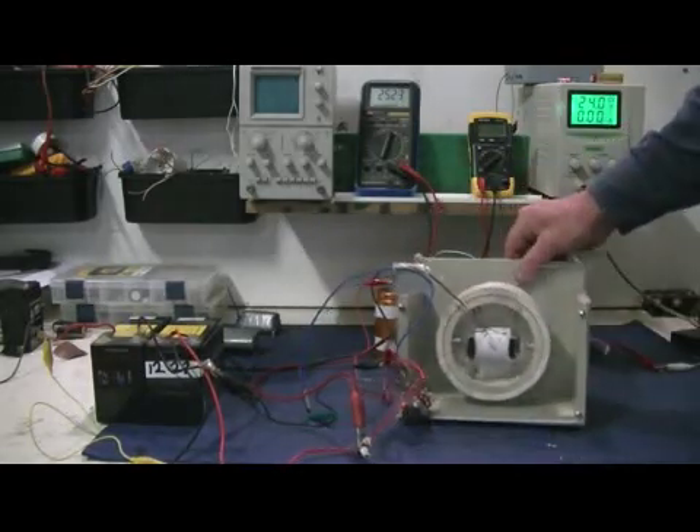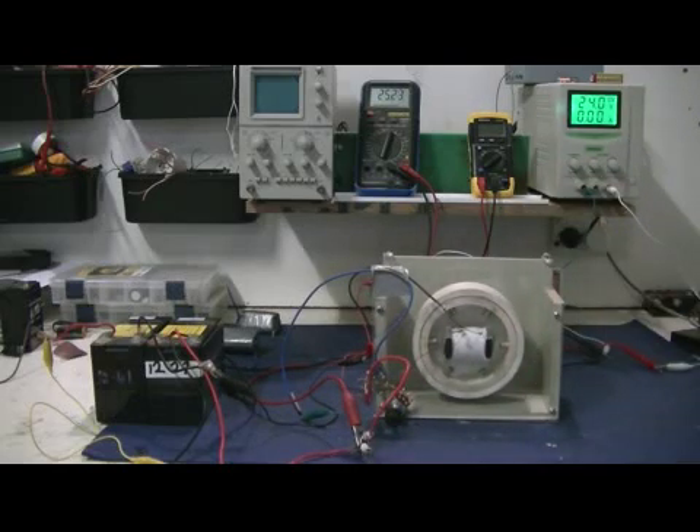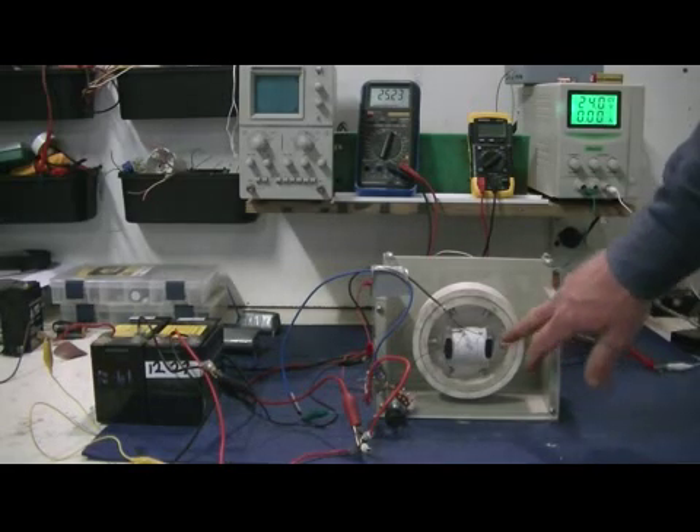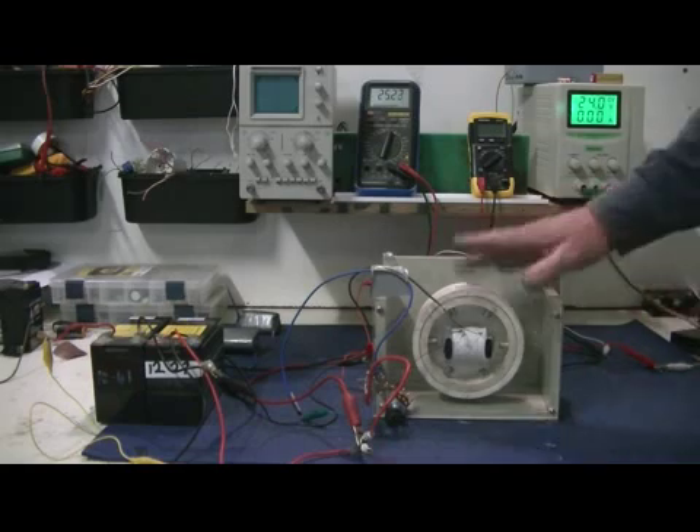Unlike most, I've built a rotor with the magnets on the outside and put the coil in the middle. So the magnets are, of course, north, south, north, south, north, south, north, south — and believe it or not, your SSG will work like that quite fine. Don't have to be all north out or all south out. They can be alternating. So yeah, that's what I've done.